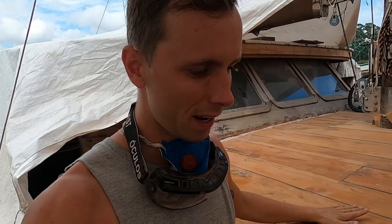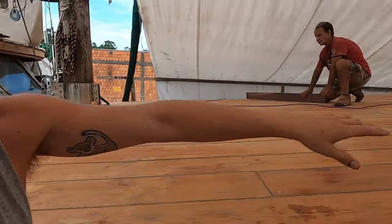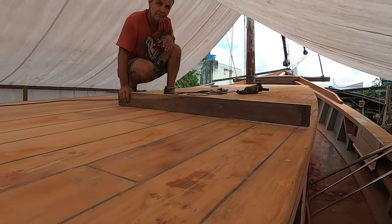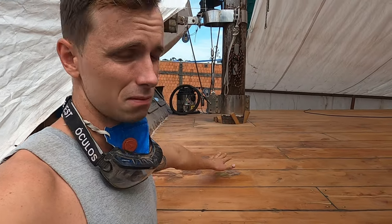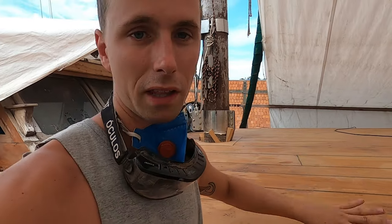We're going to leave all the works for now, except for one job, which is the roof over here. So everything's been sanded roughly already, top as well, but now it's all got to be leveled out. So Nico's going to grab the big sanding machine over there, and we're going to make sure it's nice and round all the way on the whole boat, so the water runs off it around the whole boat. Then we're going to go with some oscillating sanding machines to make sure all the little cuts and marks are out, so we can already apply a first layer of just pure epoxy to then put the fiberglass on.